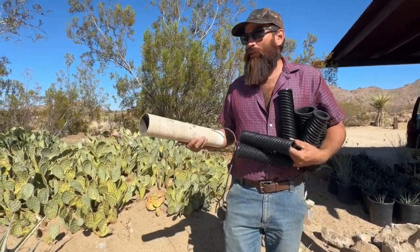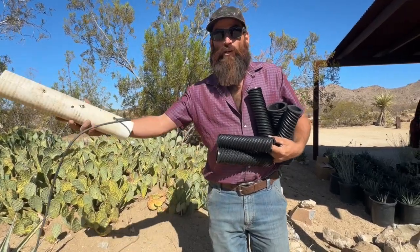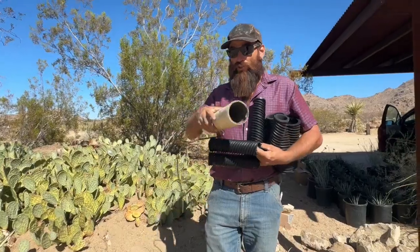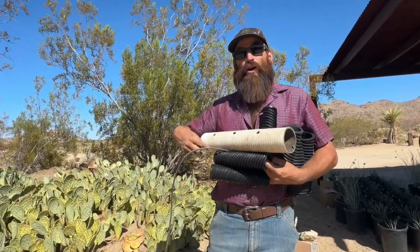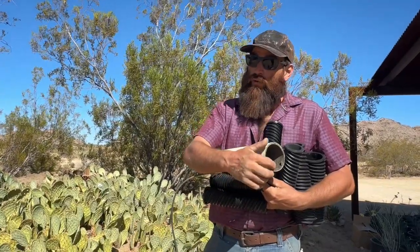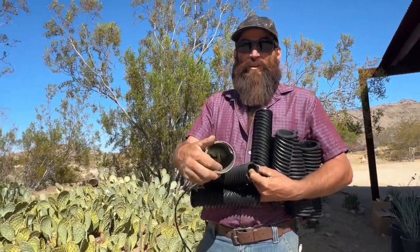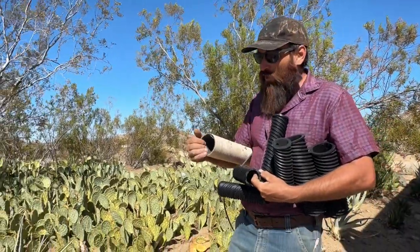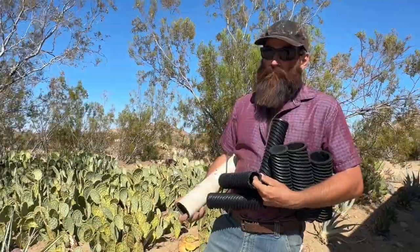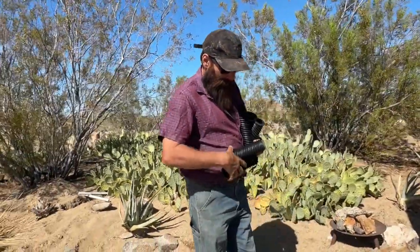It's when these are used as a drainage system that roots become an issue. Commonly, you have a house where the kitchen sink drains out into the yard, typically running through something like this. That's a situation where there's just a little bit of water traveling along the bottom — like a French drainage tube. A tree will go in there trying to find where that water is coming from. But if this is flowing a ton of water out there, that's where the roots will go — way out there. I'm not worried about that problem at all.